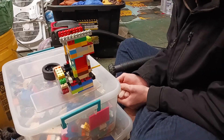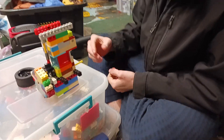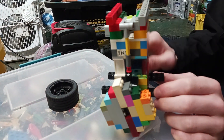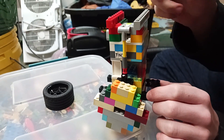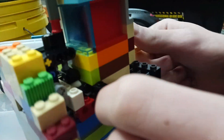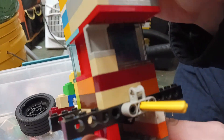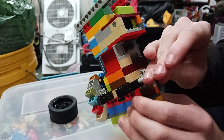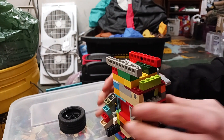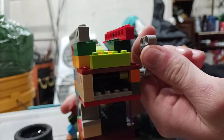Welcome back to our new video of the vacuum engine. This one is a single overhead valve — the cam is connected to the crank itself, so it takes it up automatically and brings it up here and pushes down a little valve that's inside the chamber. There's a little valve in there that pushes down, and this one sucks in the air through there — there's a little valve in there where it sucks the air through.